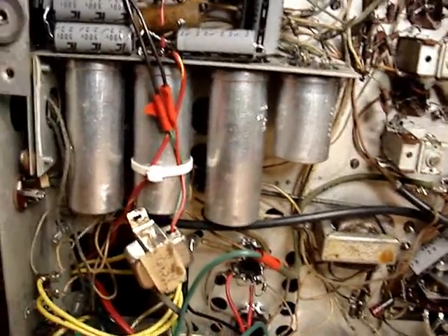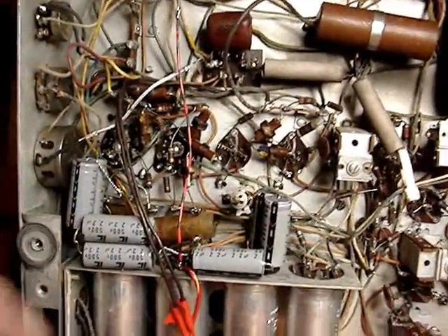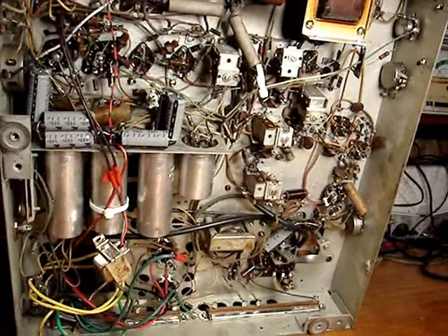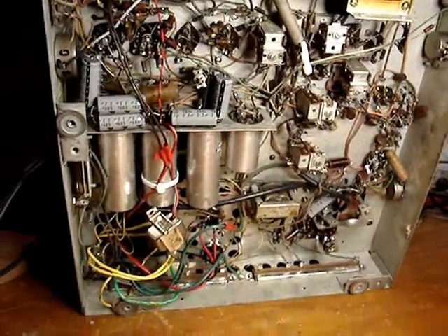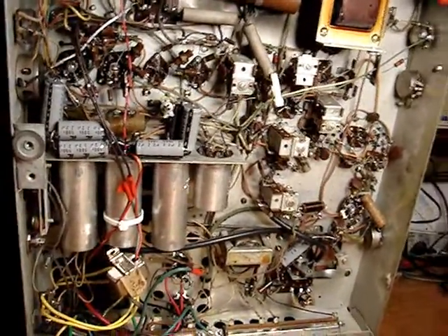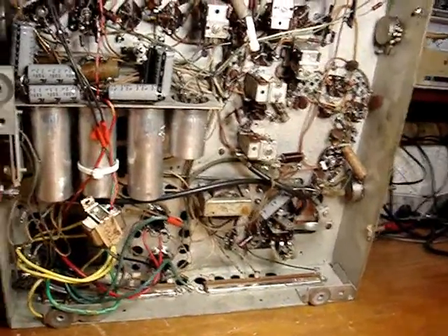That's not good — I'm going to change that. A lot of electrolytics have been put in, and I can't tell if he's wired them in parallel with the existing electrolytics. This Sony Cybershot camera eats batteries like nobody's business — they must have been in collusion with the battery companies. Anyways, aside from that, none of the tubular wax capacitors have been replaced, so he didn't do a shotgun repair. I just wonder how far he got, and of course why there's no vertical deflection. These are all the things I need to sort out.